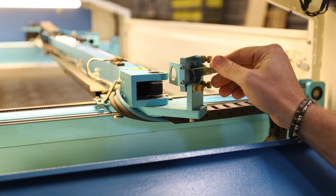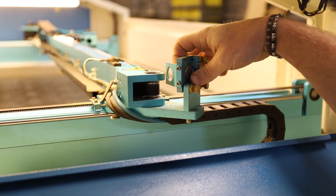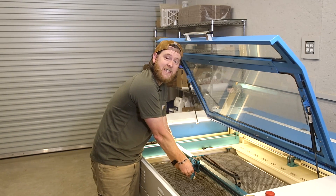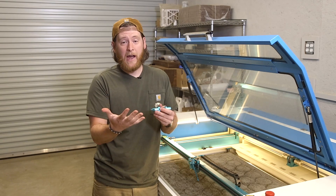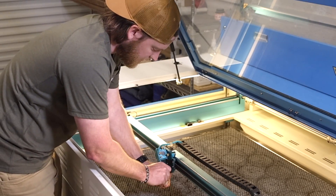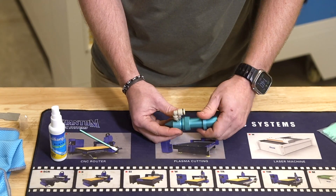If the mirrors are really dirty, go ahead and remove them from the housing. Use the little metal key that came in your toolbox to unscrew the retaining washer that holds the mirror in place. Be careful with these lenses — you don't want to drop or scratch them. Also be careful not to turn or adjust any of the alignment pins on these mirrors. The lens down at the laser head can get a lot of soot or dust from cut material, which builds up around the hole where the laser exits. This will reduce the quality of the cut and the power of the laser, so pull the air line out, unscrew it, and remove the whole head assembly to bring it to the bench and get the lens inside clean.